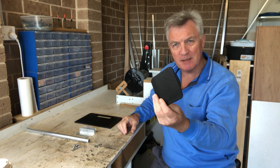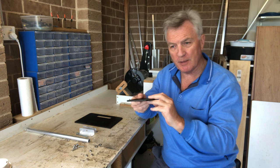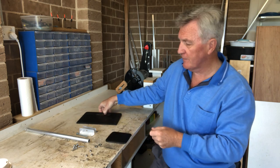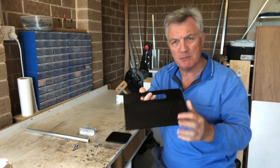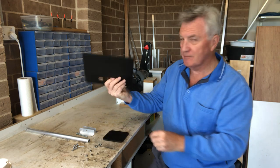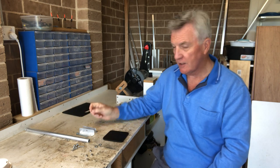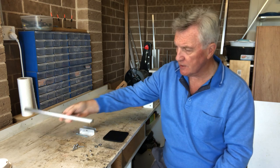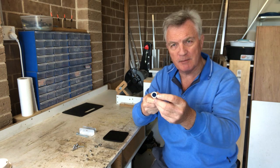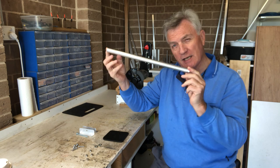I start off with a basic plastic pad. This is 110mm square — quite large because I found that on my previous platform it gave me a very good footprint for the legs to hold me in the mud. It's about 5mm thick and it was made from one of these chopping boards. Dirt cheap — I got three of these for virtually nothing at the local cheap store. I'm going to use the 20mm round legs. This is 3mm in width and I've drilled a 6mm hole in the bottom. It's 350mm long.